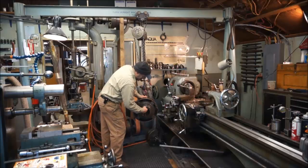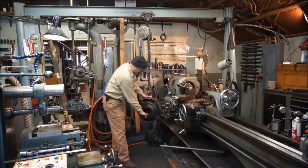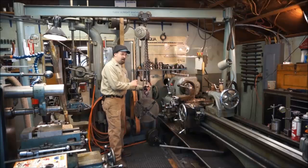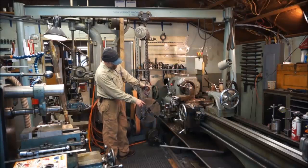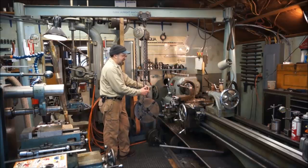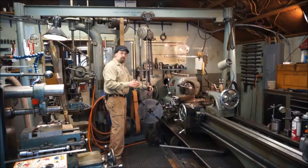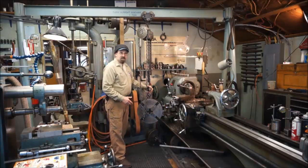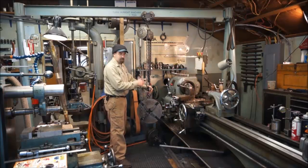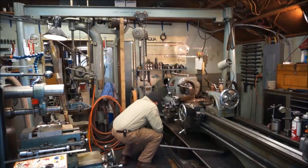Okay, now this, we still keep this wet. We always make sure that this has enough oil and stuff on it so it doesn't rust up on us. And this has a light sheen on it right now. It'll go back underneath here, and we'll blow or clean out the chips that are usually under it. And we keep it directly underneath our lathe right here. Sometimes it does build up a slight bit of rust on it, but I don't want to drench it down with oil because it gets a lot of dust, and I just don't want it to be caked up on there.